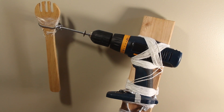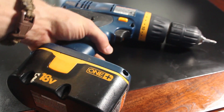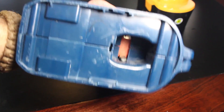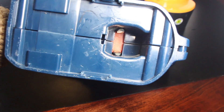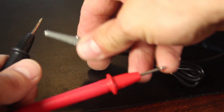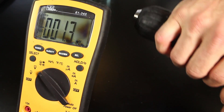This little black plug symbol shows that it's charging, and it only appears when the phone gets around 5 volts. Let's build our makeshift phone charger. I have a cordless drill I think I can convert into an electrical generator by running it backwards. I'll remove the bit, take the battery out, and looking up into the handle, you can see the two terminals where the battery would connect. For testing, I'll attach alligator clips to both of them and connect the leads to my multimeter. When I pull the trigger and twist the rotating end of the drill, I'm generating around 5 volts — and that's what we need.